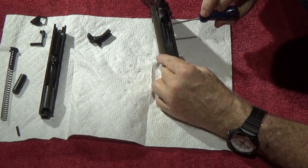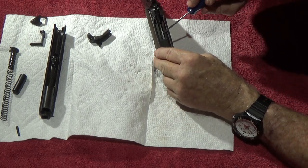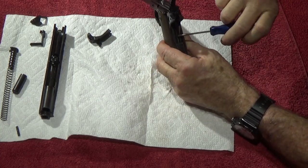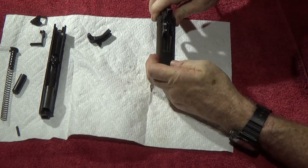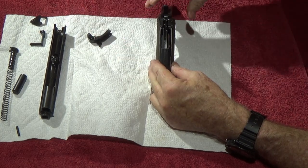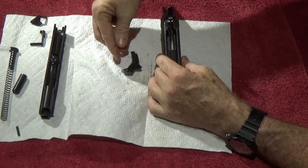I like to grab the tail piece with a small screwdriver or pointer to get it started and keep sliding the main spring housing up. Stand it up to let gravity work with you. So many of these things on video are twice as hard as in real life. Make sure that long strut is inside the cup, then the next step is to get the grip safety back in.